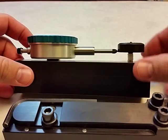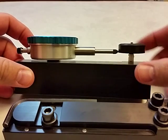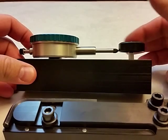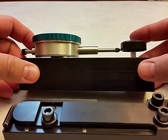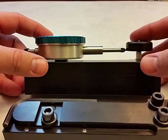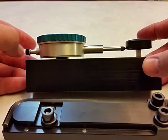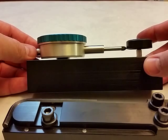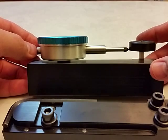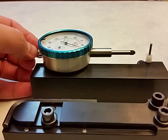So you can see the setup and how it works. It's important to keep your wheel in the same place and to fit a decent-sized pin in the wheel. The closer the pin you have, the better the reading you're going to get. With the wheel bore variants, I find the .0965 to give a solid factory starting point for a gauge pin.